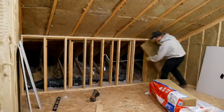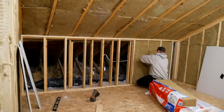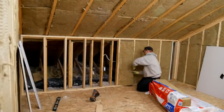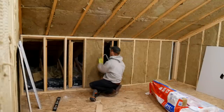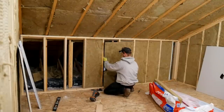This is why I opted to quickly build those knee walls instead of trying to cut down and pinch all the comfort batts into place. These comfort batts are made for 16-inch centers so they slid right in — no staples necessary. If you do have to cut around an electrical outlet, quick work with a knife and it slides right into place.